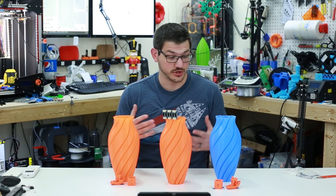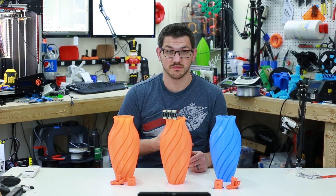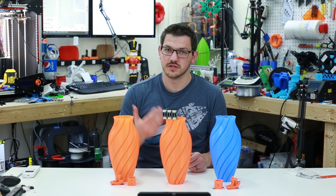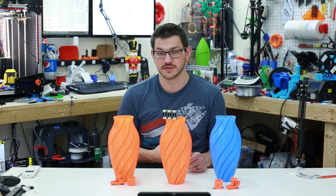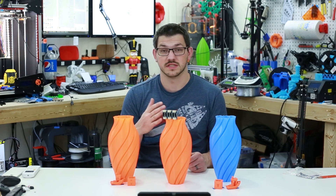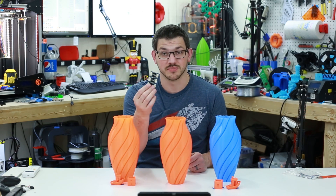The whole point was just to show my experience using TL smoothers on an MKS S Base 1.4 board, which uses integrated DRV 8825 drivers. Those DRV 8825 drivers are very commonly used in Tevo products — the Tevo Black Widow, the Tevo Tornado, and the Tevo Little Monster all use these steppers. And a lot of people are correcting all of their artifacts by simply adding these.